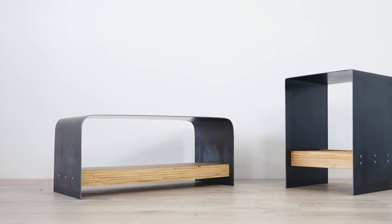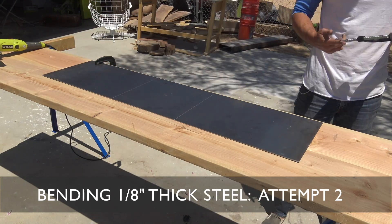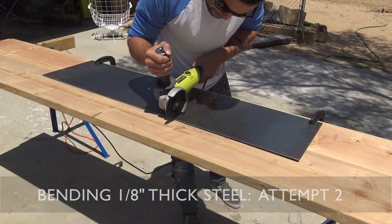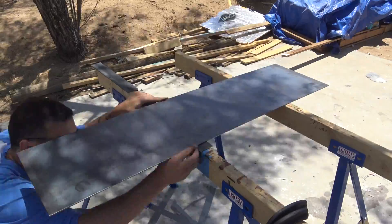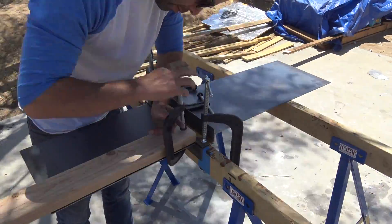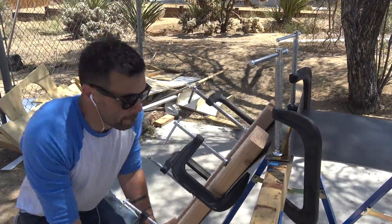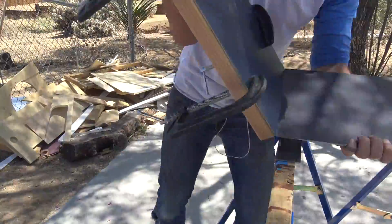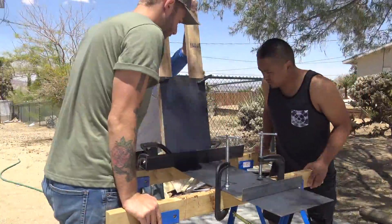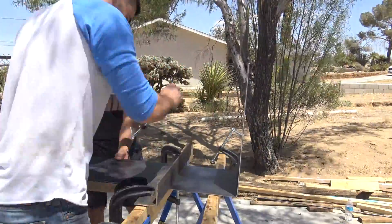This came out okay, it looks cool and all, but I wanted to see if I could come up with another technique where I could get sharper right-angled bends. So I got out another piece of steel the same size and the same thickness, but this time I used my angle grinder to score some lines about a sixteenth of an inch deep into the plate steel. Once again, I sandwiched the plate steel in between steel angles and then clamped it to some sawhorses. I lined up the steel angles with the line that I scored, and this time I used 2x4s for the handles. My 2x4s were a little bit long though, so I had to flip it over. Now I'm bending with this scored line ending up on the inside corner of the bend. The bend was coming out nice and clean, but the whole contraption was a little bit rickety and I needed some help to hold everything stable while I did the pushing.